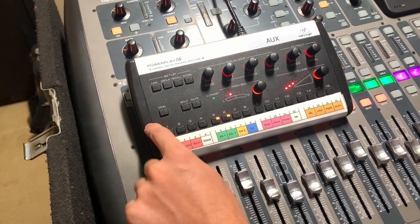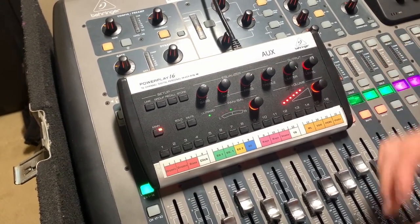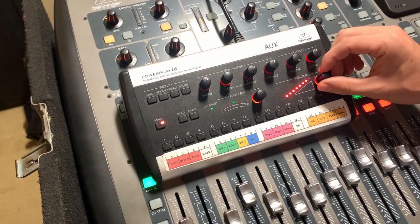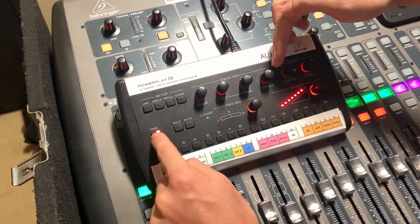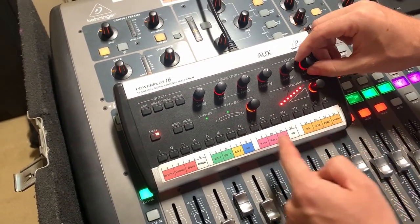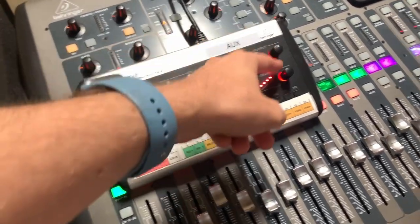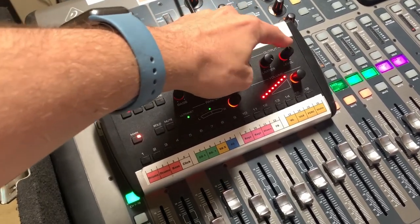The last thing is main volume. Pressing the main volume button selects it as a separate volume control — a pre-limiter volume. So there's a chain: this volume sets how loud before the limiter, the limiter acts as a ceiling, and then the output knob is your final output after all of that. Best practice: keep main volume all the way up, and adjust your output from the main output level.